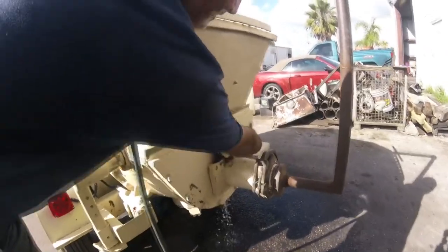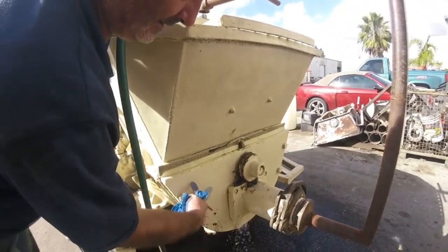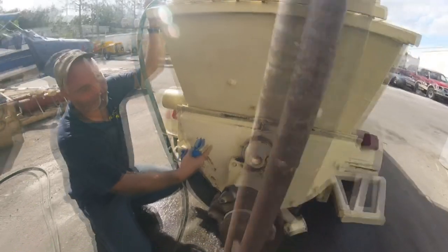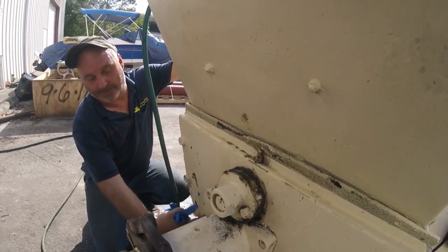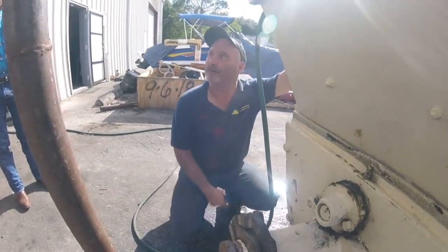You take your transition off, take your keyway off, and then spin your main acorn off. This face plate will come off, boom, drop to the ground. If you want to replace the mirror plate that's adjoining to this, you have to take this off. You take these 4 bolts off and knock this off, there'll be 4 other bolts in there. You take them 4 bolts off and that plate will fall off.